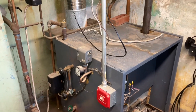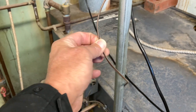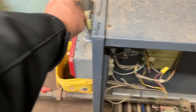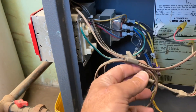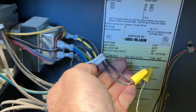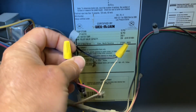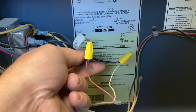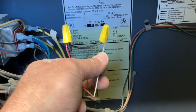The customer wants to be able to control the heat remotely by wi-fi. Right now we just have a two-conductor thermostat wire leaving the boiler, going all the way to a standard battery-operated heat-only thermostat. Now on this boiler, inside the boiler vestibule where all the wiring is, there is a transformer with a connection labeled 'thermostat' — factory label — two black wires. You'll see this on a lot of different types of residential boilers, where you have two leads making it easy to hook up the thermostat. This would be RH and this would be W as far as terminals.